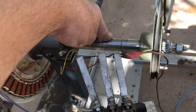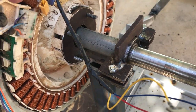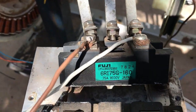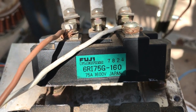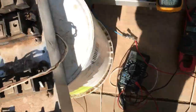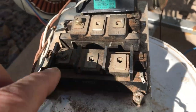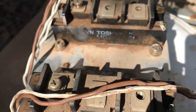That's just the spindle drive from the Smart Drive. I made up a bearing housing — a crude one, but only out of scrap, didn't spend any money. Used the grinder to cut the round disc, a hole saw to cut through there. I have a heavy duty bridge rectifier I found in my scrap — 75 amps, 1600 volts — so that does the DC conversion. There are some high-voltage switches like transistors; these must be triggers and these are the power outlets.